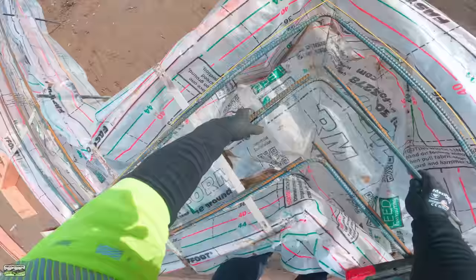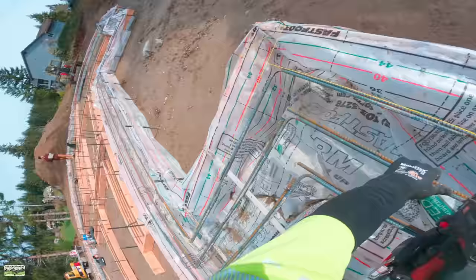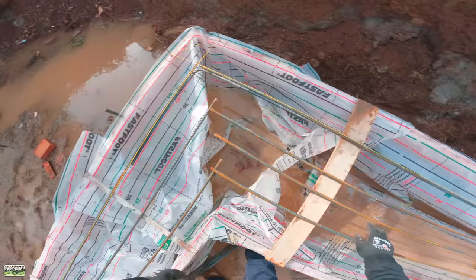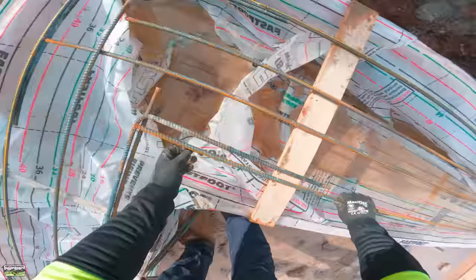We buy the wire rolls by the box through White Cap. What I'm doing is I always look down each run to make sure I'm staying parallel - it's not critical to be perfect, but the better the rebar looks, the better your inspections will go. It's always nice when the inspector shows up and says 'that is some pretty looking bar, boys.' That's what you want - you want the inspector to respect your work, because when they do, they talk about it with other people and it makes the inspections go easier. Trust is a good thing.